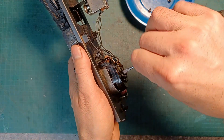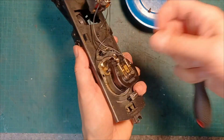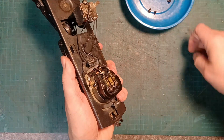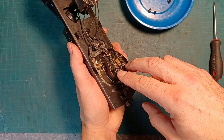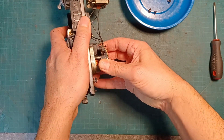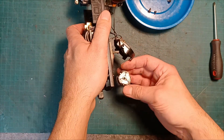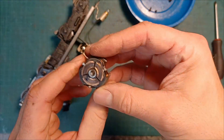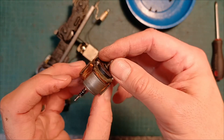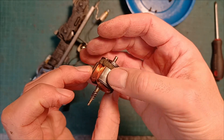This is just the grounding tab, so we'll get this out first. Now we've got the brushes here — when you lift this off be careful they don't pop out and roll off the bench and you lose them. The motor came right out with it. That is pretty dirty, it's got a lot of use in it. The slots here aren't too bad, but there's a little bit of surface rust starting on these. First thing I'm going to do is give that a wipe down with the green scotch pad.